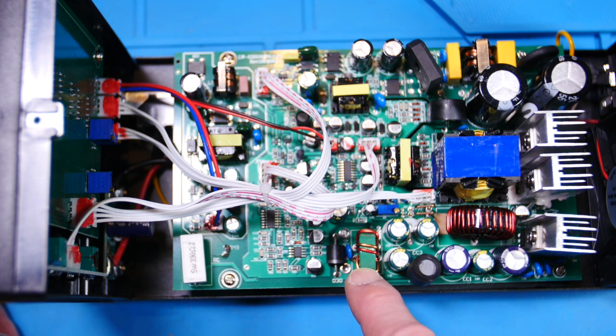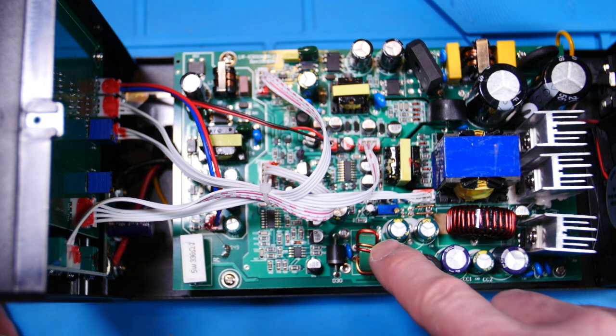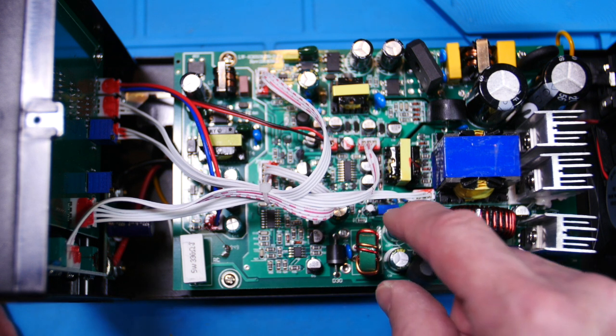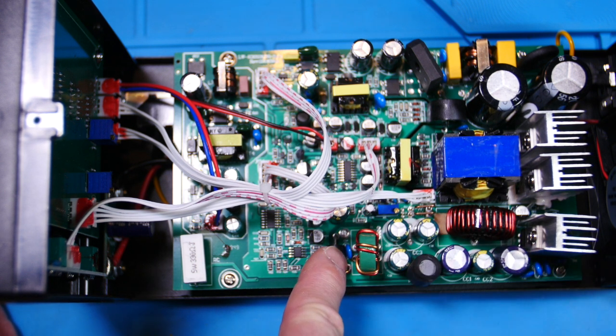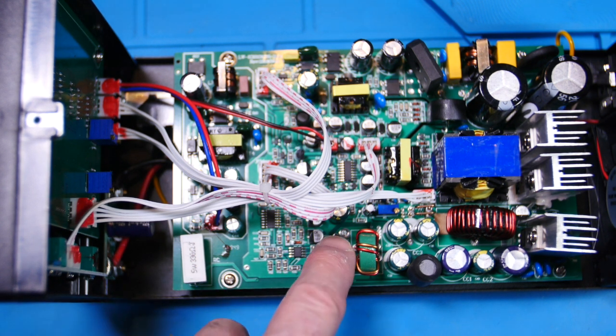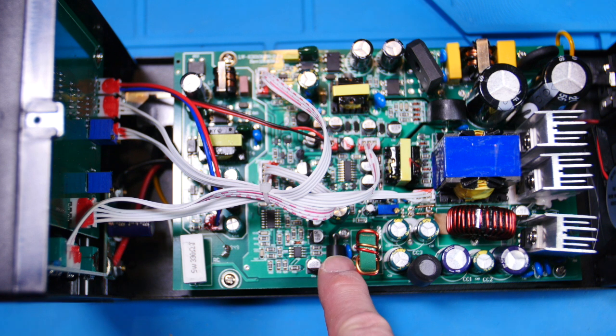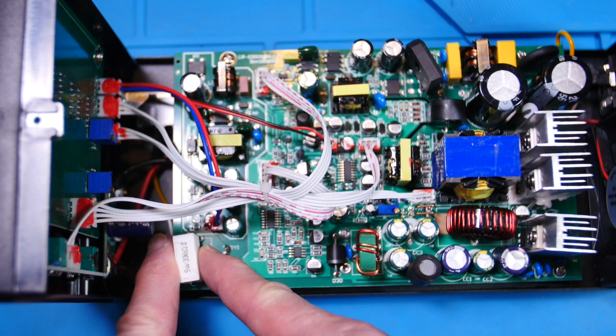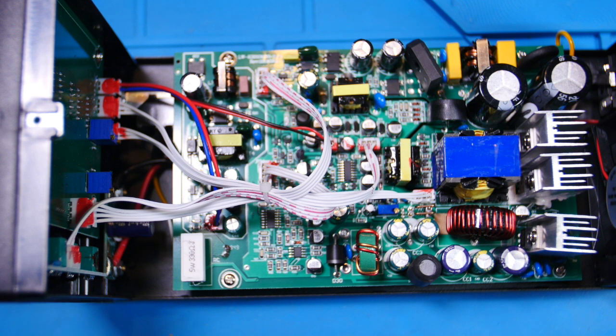This is a common mode choke. It's interesting, they actually used two different colors of magnetic wire. So yeah, and then there's a white or a ceramic capacitor on the output of that combo choke, and then this big old diode. That might be for reverse voltage protection on the output. And then it looks like right there the terminals are the wires that go up to this board up here. Whoops, knocked over the resistor there.